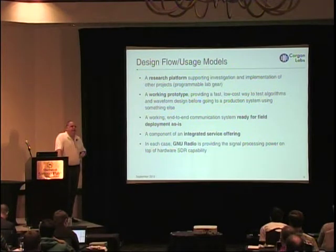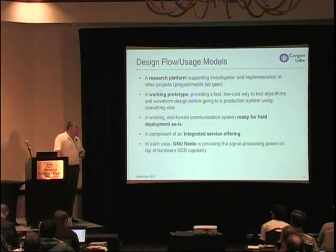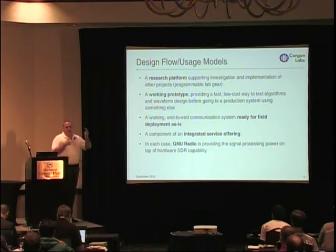Last year I talked about the Path Intelligence application where they are using USRPs to instrument a volume of space and look at the GSM uplink bursts that are created by mobile phones of people walking through that volume, and are able to correlate and obtain location of the phones and look at unique identities. The way they're making money with it is to do that at shopping malls and tell the owners of the malls various information about which stores people go to on what days and things like that.